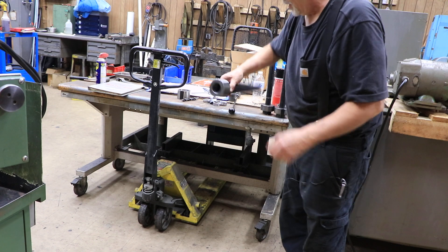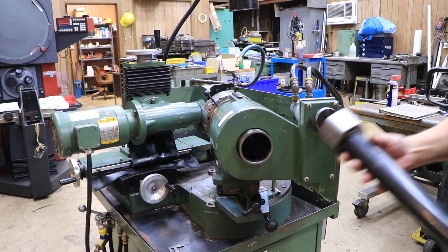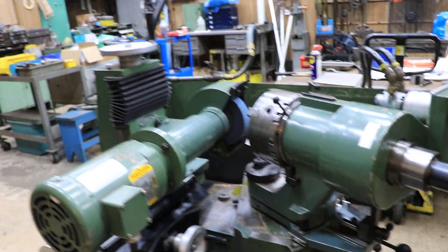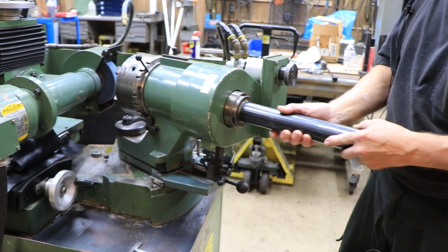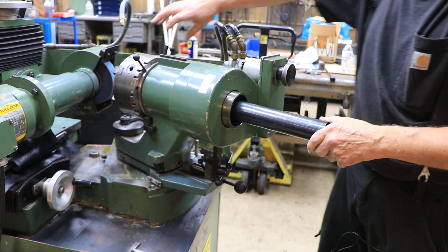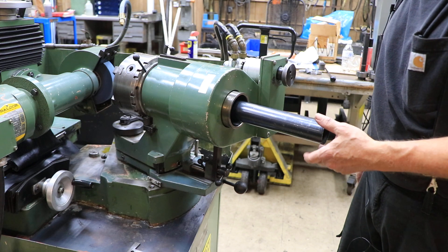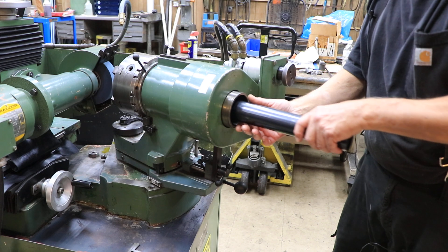We'll take the big one here. So let's say you put your big drill in there that has a Morse Taper No. 5 — it's going to be sticking out about this far, maybe even longer. You're going to get it in there, get the drill through the front jaws, and send it into this tube. This is going to hold it and center it perfectly. Get it down there wherever you need it and lock your jaws. That's how you hold the Morse Taper No. 5 shank drill, or the 4 or the 3 or the 2. They all come with this.